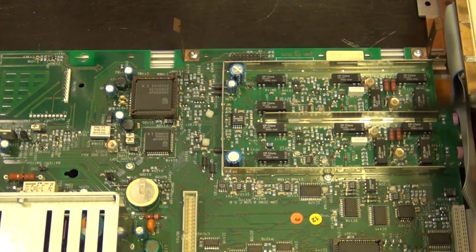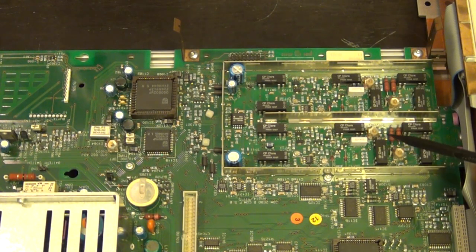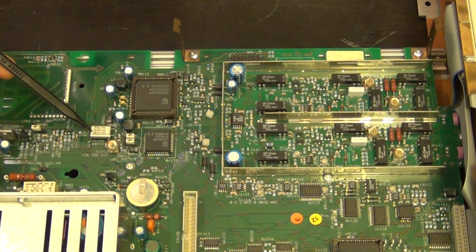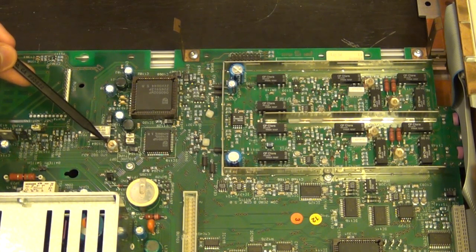And you can see a couple of different adjustable capacitors. There's a whole bunch of adjustable capacitors, in fact, here to equalize the frequency response and to tune things and make sure that you can count reliably across the entire range. But ultimately, at the very end of the day, the very simplified method of operation has to do with basically counting pulses. You have a reference. In this case, we have this rather pathetic crystal, 10 megahertz reference here, which has a variable capacitor right next to it, likely to tune it.